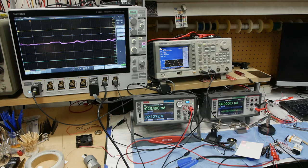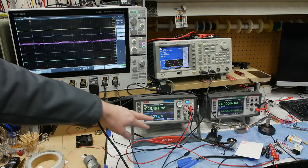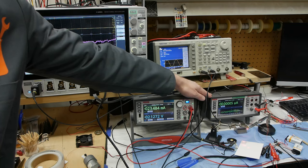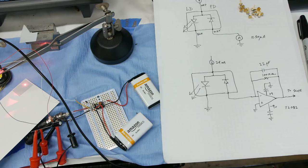In this setup we're going to use the oscilloscope to look at that microamp current signal coming from the monitor photodiode. Here you can see the power supply for the laser diode at about 24 milliamps. I'm actually using this in constant-voltage mode because I very carefully characterized this specific diode. I have a circuit over there that's converting that microamp current signal into a voltage which we're displaying on the oscilloscope. Let me show you what that circuit is.